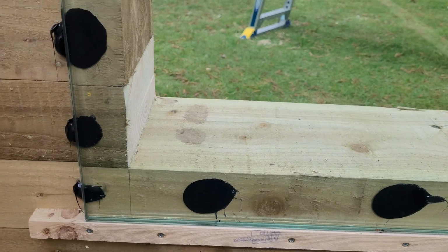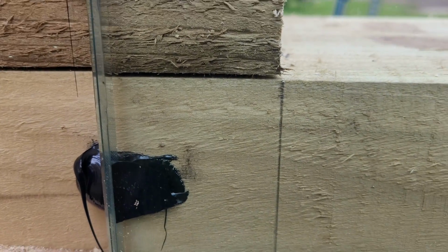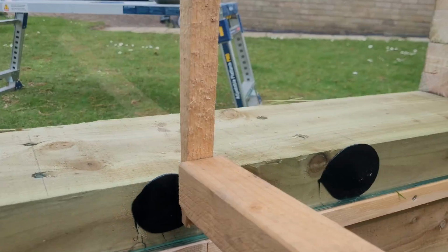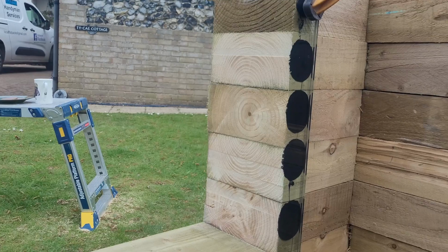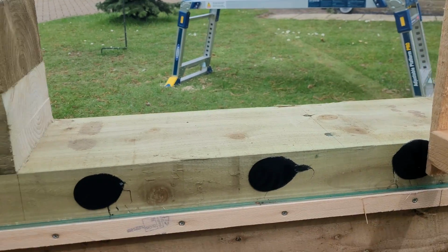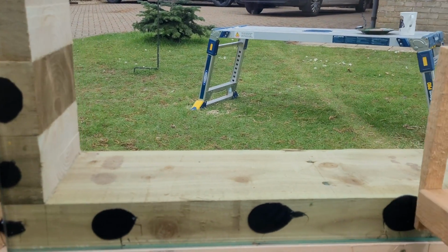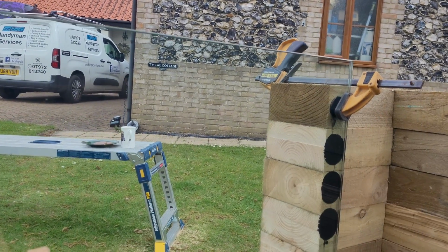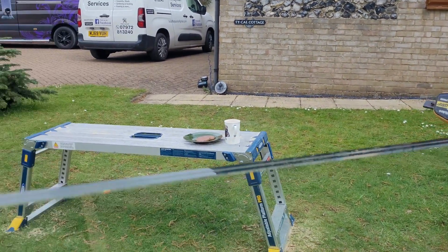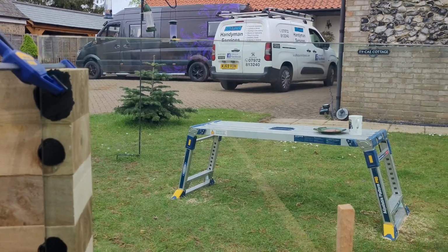So yeah, you'll see not every single blodge has splattered very, very perfectly. Like we've got this one down in the corner there, is touching the window but not squished as much as these. But as I say, this is just to hold the window in place while the window is setting, and it's the next stage, gluing the liner to the window, that's the very, very important part. But yeah, that will hold that nicely. And 24 hours you can take your timber and your clamps off, and that window won't go anywhere. And the reason the window's so high is, as I say, we've got a coping going the full length across the front there, and that will then hide the top part of the window, and that will do nicely.